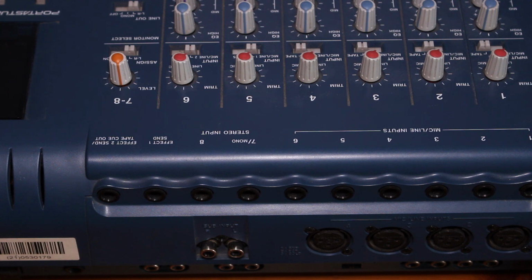Perhaps one of the more useful features of the stereo input is the fact that it has a mono feature, which allows you to only connect the mono signal of any line level signal, even a bass, for instance. And if you connect that mono signal to the left jack and leave the R jack unconnected, the signal is automatically taken to both channels. You're able to bypass the stereo feature and make it another mono line level input like the rest of the inputs on the device.